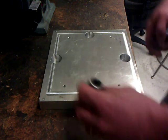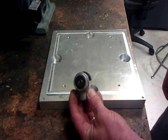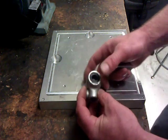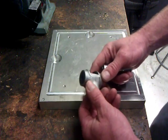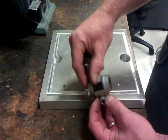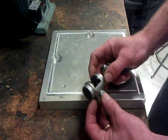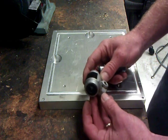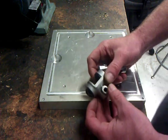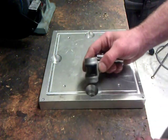Alright, so step 2 of this here, we're going to take these bushings out of this coupling. Earlier I showed you how to drive out that pin, and the reason that we don't hammer hold on to the coupling is because this is just pot metal. If you hang on to this and start driving those bushings, especially if these are deteriorated with stock ones, you'll break this coupling, or the housing. It's just not that strong. By holding on to the steel shaft, which is actually where the pin is pressed in, you have a much better chance of driving that pin out, especially the really stuck ones.